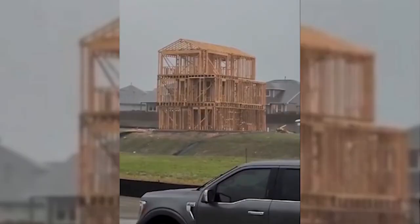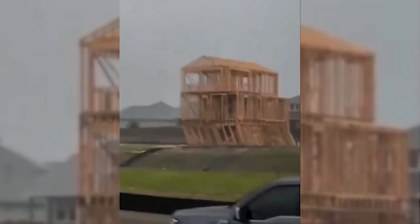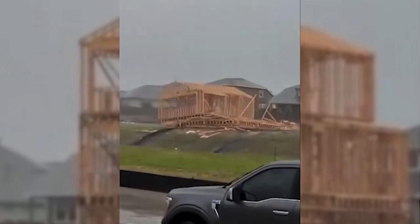But because it was a Barndominium, it needed to be spray foamed in 2 phases. And here's why. When you build a regular stick-built house, you have OSB, which is a type of plywood that goes on the outside of the house, so it prevents that from falling over. You've seen those TikTok and reel videos of the house that just gets rained on and all of a sudden it just falls down while it's being built. Well, that's because they didn't put any plywood on it, and it just folded those sticks and they fell right over instead of holding the house up firm, because it just got a little bit heavier than it should.